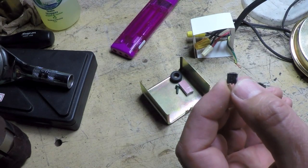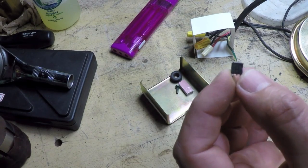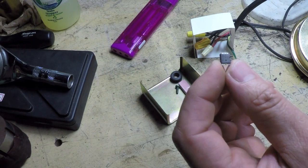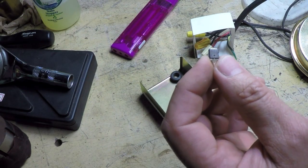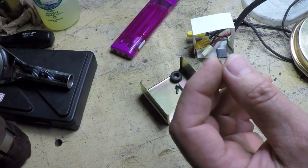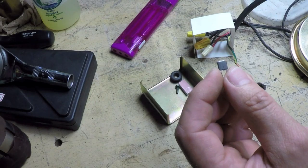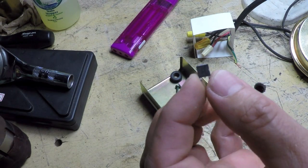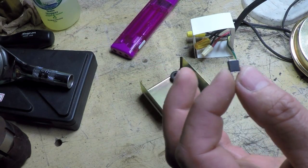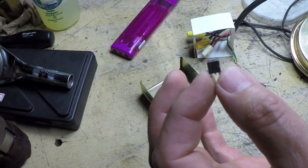The gate acts like the base and the source and drain are your emitter and collector. The most important thing is I was able to look up the pinout for both the original K7Y and this MTD3302, and they share the same pinout: going left to right it's gate, drain, source. The only thing that could make this not work is if the drive signal from the microcontroller isn't sufficient to turn on this larger transistor, and the only way to find that out is trial and error.